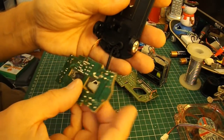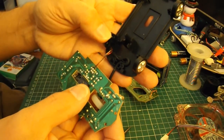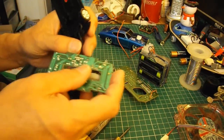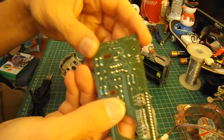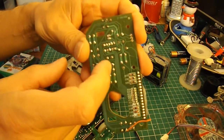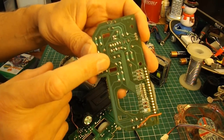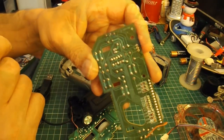I expect if we get carried away we could actually overheat the wires, but I only need it to run for a few seconds, so that'll be good enough for me. I'll switch the soldering iron on. On the back of here, I'll actually cut through the circuit tracks so that we're not interconnected to any of the other bits, because we don't need any of the other bits. So I'll just be using the switches as they are.